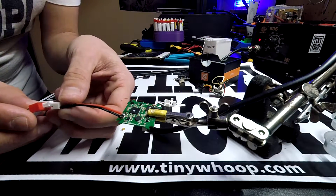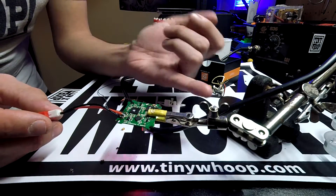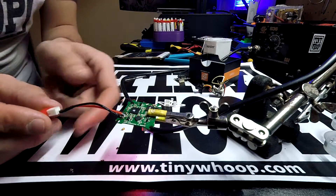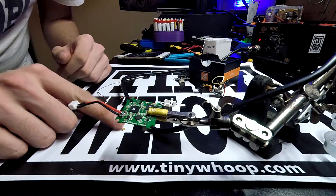If you remove it, I've heard on the group that it will still work, but I don't trust not leaving that there. I believe it has a purpose — it wouldn't be there for no reason. So we're going to actually replace it. I'll show you what happens when you plug in a battery after you've fixed it and pulled that off. Battery back in — and we're back alive, it's trying to bind. But I don't trust it, so we're going to go back and add this capacitor.